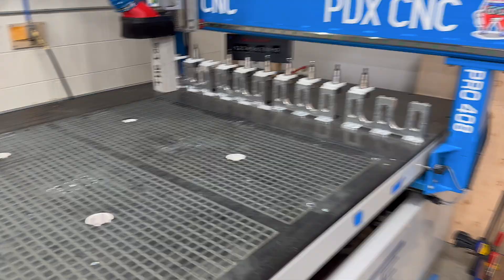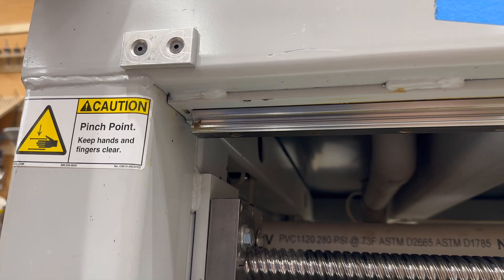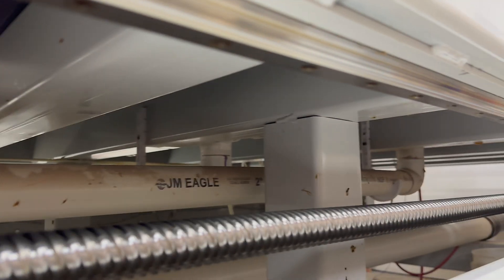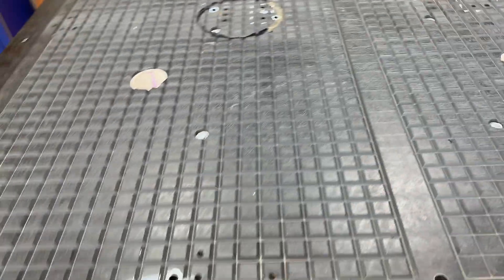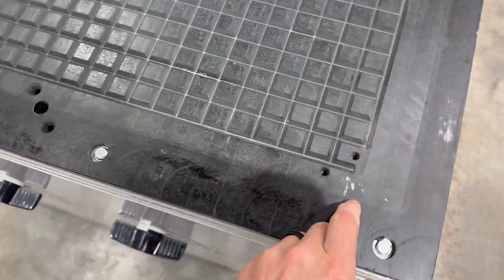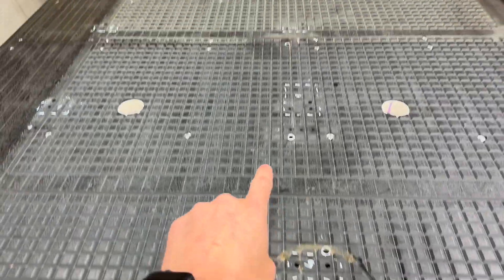The steel columns are on a normal grid underneath steel beams — you can kind of see them there. There's not a huge sidewall of steel, but it's plenty enough to tap a quarter-20 thread, which is what we used. You have to know where those columns are in advance. You can see where they line up with the bolts that already exist up here, and we used those to figure out where to put additional tapped holes across the whole table.